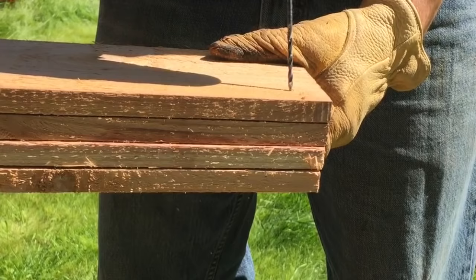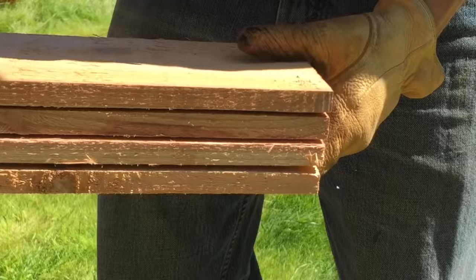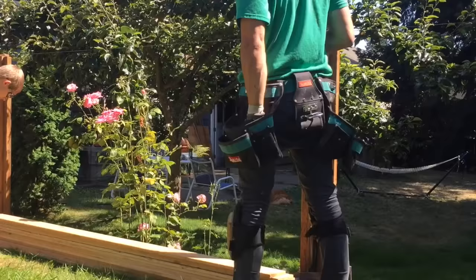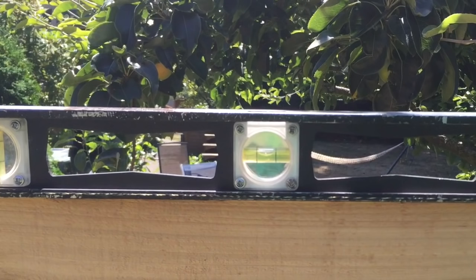The reason I have to do this step is that my cedar planks are only eight feet long and can't reach from post to post, which is why I have to put a ledger on both sides of each post. Once that's taken care of, it's time to prep my cedar planks by pre-drilling all of the holes — yes, all of them. Do not try to avoid this step because if you do, your boards will crack when you start screwing into them. I know from experience.